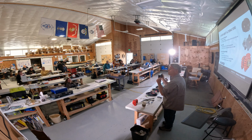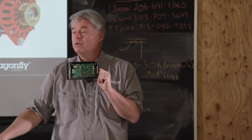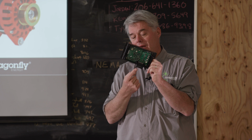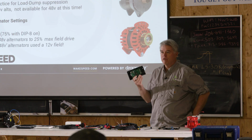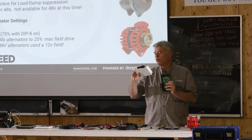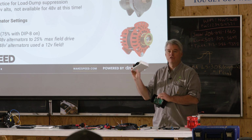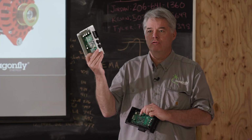This was primarily designed for OEM customers. They don't need the flexibility of the dip switches because they configure these things 100%. They take the CAN out through the harness. So when you purchase your regulator, you're going to find these two different variants. Today, there are reasons to pick the white box, specifically Victron, because some batteries use RJ45 for their CAN bus. So that's one reason to make sure you do this.